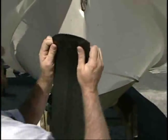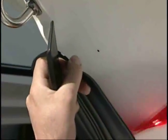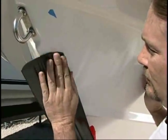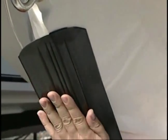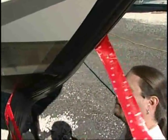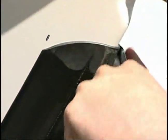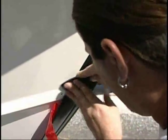Carefully pull back the center liner or sheath 2 to 3 feet, exposing the 3M adhesive tape. Start removing the sides of the protective liner, being careful not to touch the adhesive to anything that could contaminate it, including your fingers. Align the Keel Guard with the center of the keel and press on by hand or with the burnishing tool. Be extra careful not to touch the adhesive and Keel Guard to the keel until you're satisfied that it's centered and aligned properly. Once the adhesive touches the primed surface, it becomes a permanent bond and will not let go without tearing the adhesive tape. Pull back the protective strips on one side at a time, 2 to 3 feet, and begin pressing on with the tool. Work from the center outward to ensure no air is trapped between the hull and adhesive.